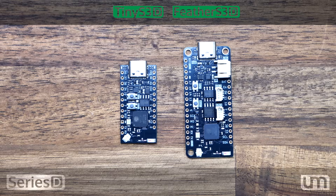Let's have a look at the Tiny S3D. It's the same as before except you can see there is an onboard antenna and a UFL connector for an external antenna. By default the onboard antenna is selected via a tiny EBD RF switch controlled via user code on a GPIO — you can change it between the two in code. The board also has a new charge IC and an I2C fuel gauge, so there's no more ADC pin to read battery voltage; you now use the I2C IC to get battery voltage, percentage, charge state, and everything else. The board is exactly the same as the original Tiny S3 except I needed to make it about 1.3mm longer to fit the RF layout in, and I've switched the 1515 RGB LED to a 1010 sized RGB LED.